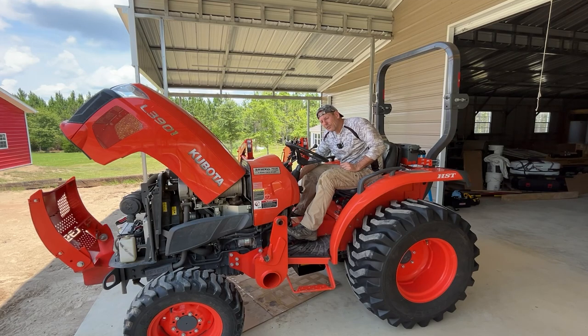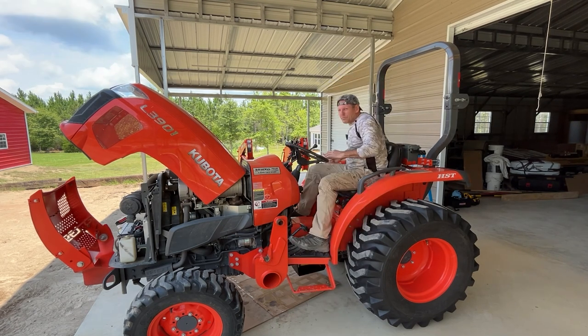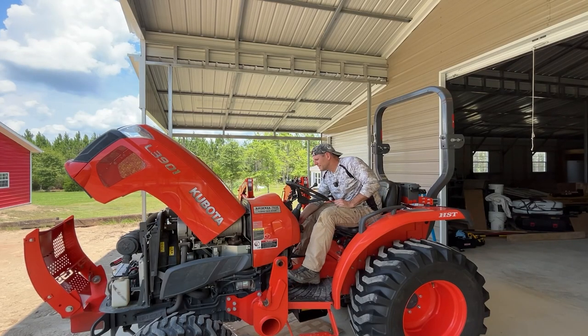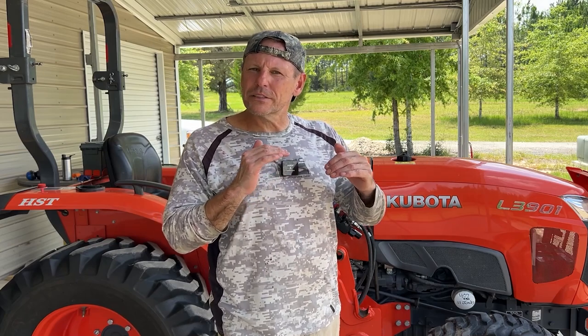Here goes nothing. Turn the key on — we might have to bleed the fuel again. We needed to bleed again a couple of times, but once I got the fuel system bled she ran just fine. I checked all the oil levels — engine oil and hydraulic — and got them both right up to the bottom of the top mark on both dipsticks. She's good to go and ready to have the loader put on and get back to work. I'll put in the description below the oil, the filters, the wrenches — just everything it takes to service an L series, so you'll have a one-stop shopping guide for your 400-hour service. There are other aspects of the 400-hour service like inspecting the fuel grommet, greasing, and other things, so be sure to consult your owner's manual. Never rely on someone from YouTube to maintain your tractor. Until the next one, y'all take care out there — and remember, life's short, tractor hard.